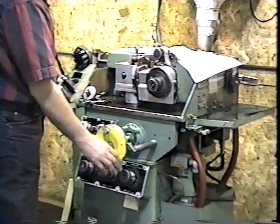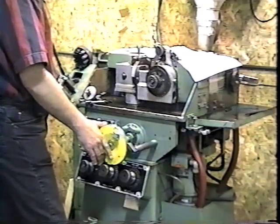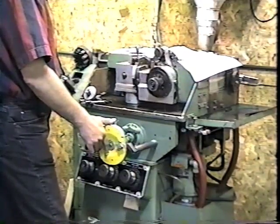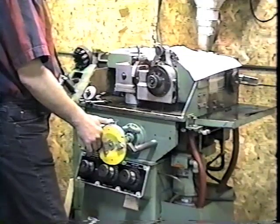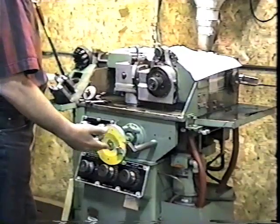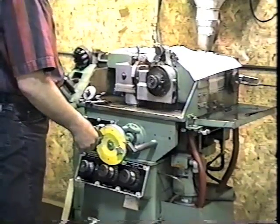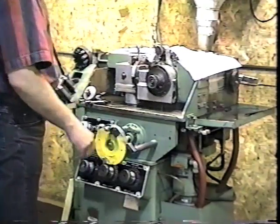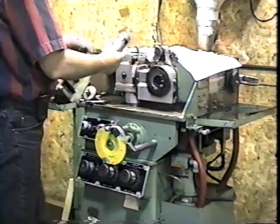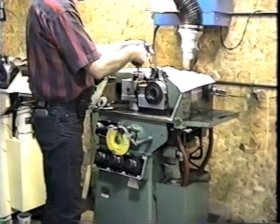I turn the coolant switch on and start grinding. I know I'm going to hit right about my target. On a half-inch drill I can feed it faster than the three-quarter inch. I set it in and give myself about six or eight cycles to finish grinding and put a nice finish on the drill. Now I backed off the wheel without a grinding sound, remove the drill, check for my geometries — and I have them.